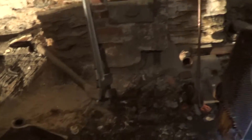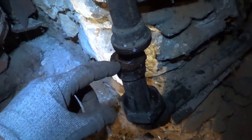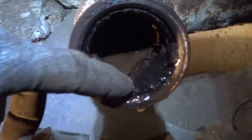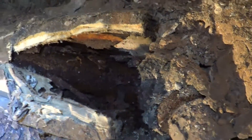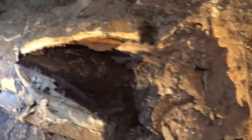Whenever a boiler is worked on, you have to look at the condensate. Here's a really long condensate line — I'm going to do a suction on that. It runs way down — see what condition that's in. Right here, that thing's starting to clog up, so I'm going to clean that out. This one here needs to be replaced. The pipe got buried in the dirt from the wall, and that's always a bad thing because it brings in moisture and keeps that pipe wet. So now there's like nothing left — the iron is basically turned into sponge on the condensate line, so I've got to change that pipe.